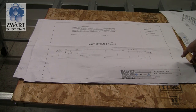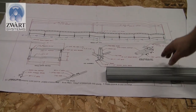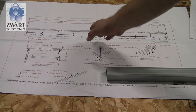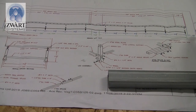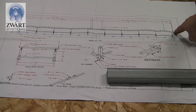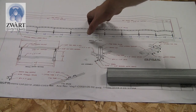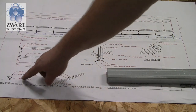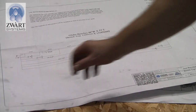After that we go on one-foot spacing to fill in the gaps. The final drawing is where you'll get most of your information — leg spacing, middle gap, splice locations. Each end: it's six and three-quarters inches from the end of the two-by-two to the first leg on both sides. It also covers bench side profiles, lateral supports, how a stand goes together, splices, tubing, and hat profile. This is a very important drawing to keep in mind.